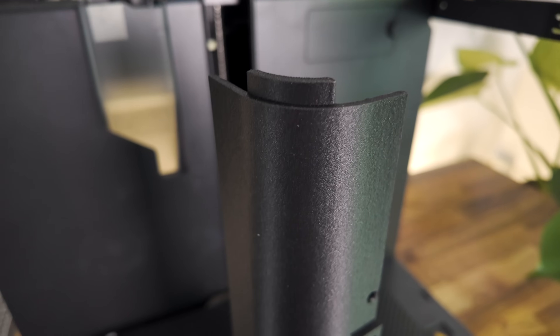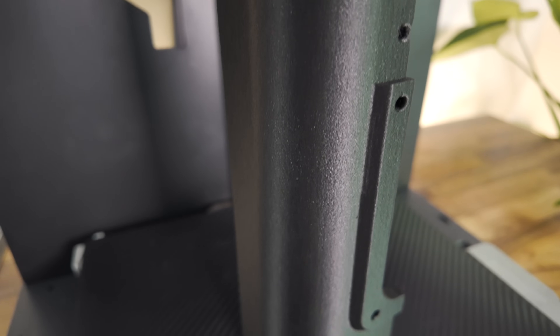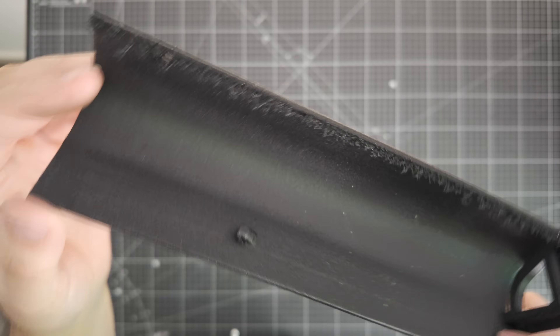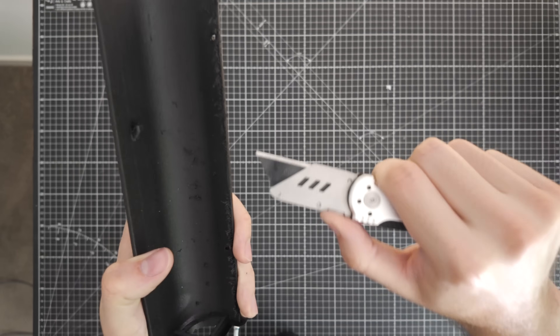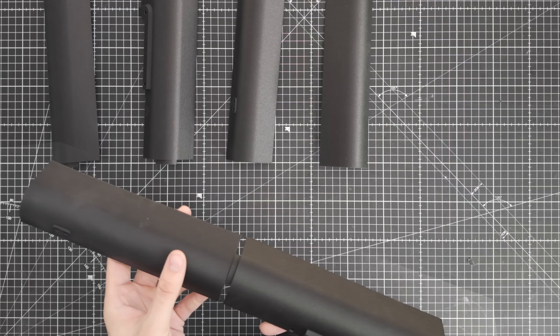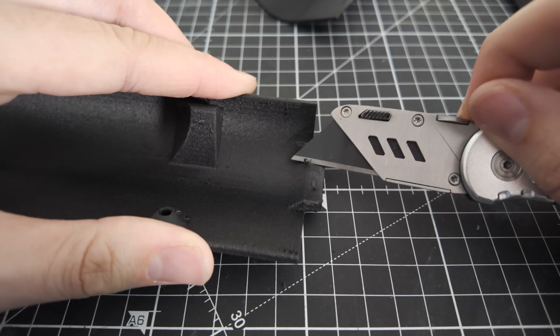Even though I recommend printing everything in PETG, I've decided to use nylon carbon fiber filament for the corners, which I think is more appropriate for this video. I was able to print these on a friend's X1C — the surface finish is absolutely amazing, it looks like galaxy filament was injection molded. The only issue was significant stringing on the rear side requiring post-processing. Little did I know that the nylon carbon fiber parts had expanded so much in the past month that the tabs did not fit together and needed a second round of butchering.